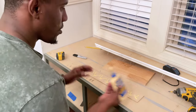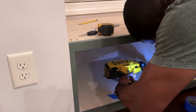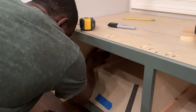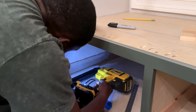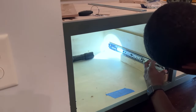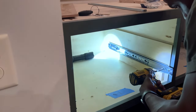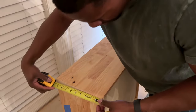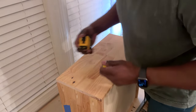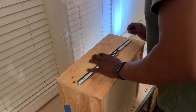We had to add some spacers on the inside because the face frame was about a quarter inch off. I added quarter-inch pieces of MDF to the walls so when the drawer slides were installed they didn't interfere with the face frames — the boxes were already built based on the face frame size. Then we installed the drawer slides using a little spacer at the bottom to get everything evened out, marked where the drawer slides needed to be on the sides of the boxes, scribed a line, and marked holes to drill for the drawer slides.